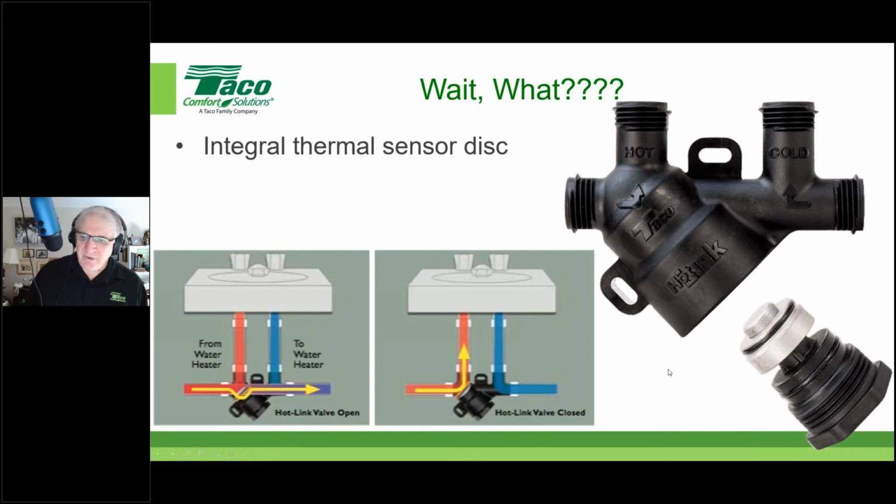All right. What we have to prevent this from happening is right over here. If you look to the right of your screen, the cartridge that comes with this, that's part of the package, has a thermal sensor disc. It's a bimetal disc sitting right there on the end of that cartridge. And what the bimetal disc does is when the water's cold, it stays open, and when the circulator runs, it allows flow to go through the valve,